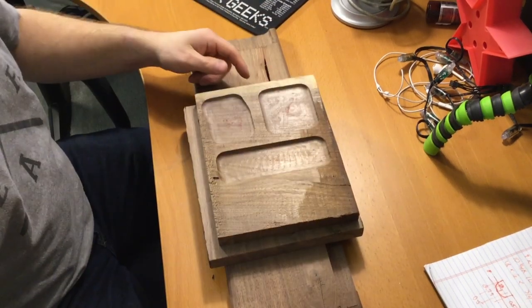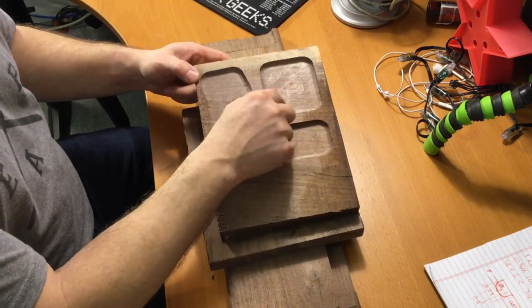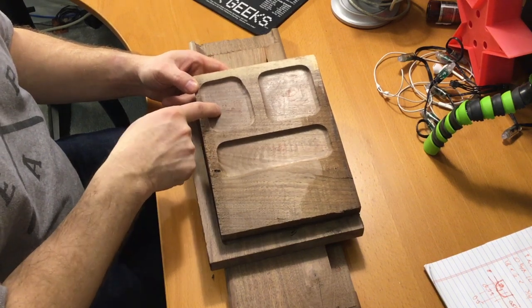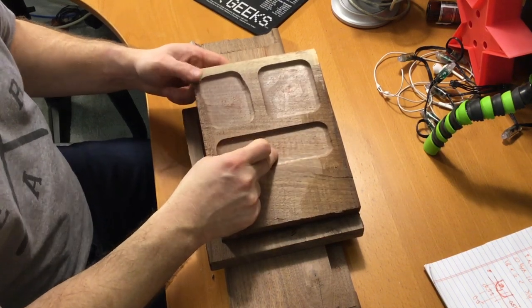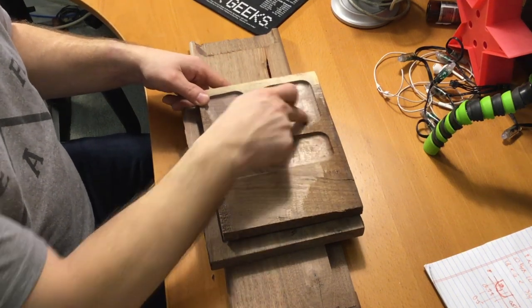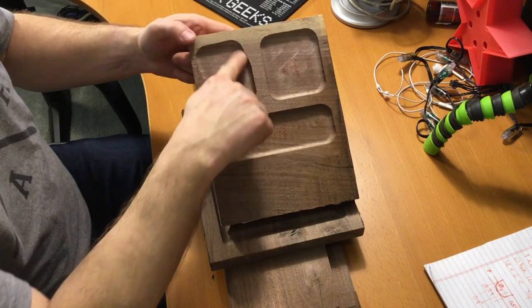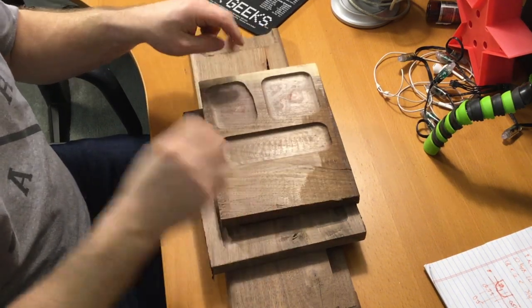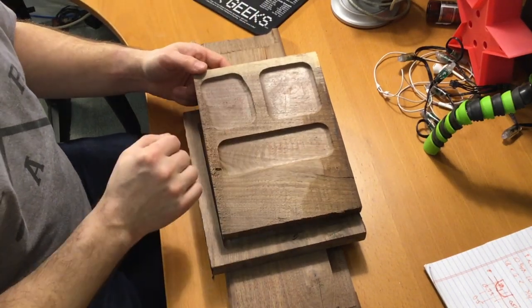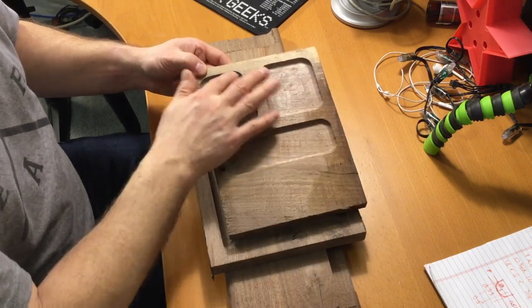I did a pocketing with this bit as well. So 60 inches per minute at 1/4 inch depth of cut, 0.25, 80 inches per minute at 0.25, and then 100 inches per minute at 0.125, or 1/8 inch. The results were similar. It's about what I expected. Now you can see here, it's not straight. I did not screw this down tight enough, and it started moving when it was cutting, but it's not a huge deal. So again, a little bit of chatter on all of these.